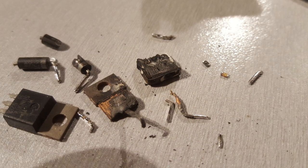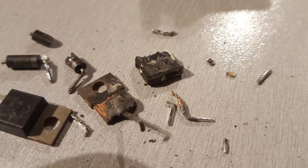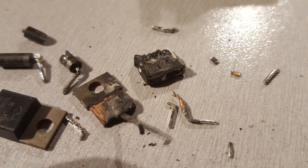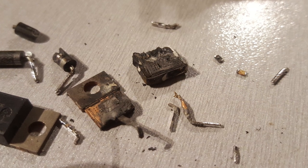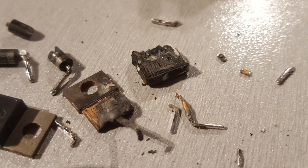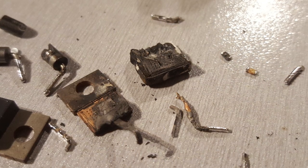When I fix the power supply transistors, I change all of them and the gate resistors. You can see the power supply transistor which is completely damaged, one diode completely broken — both were defective. The small parts on the right side are the gate resistors. According to the schematics they were around 67 ohms, and I replaced them with 47 ohms.